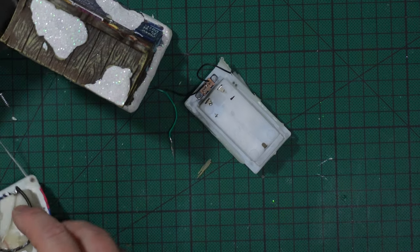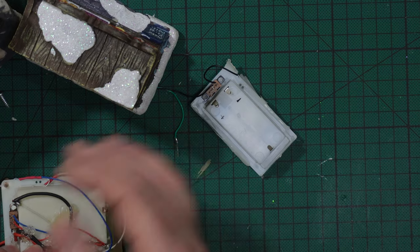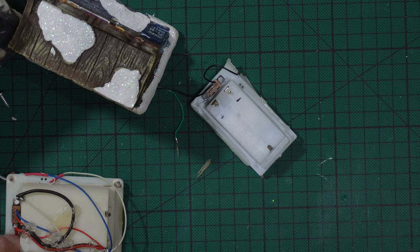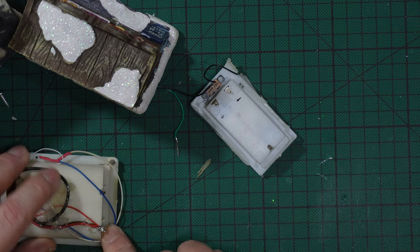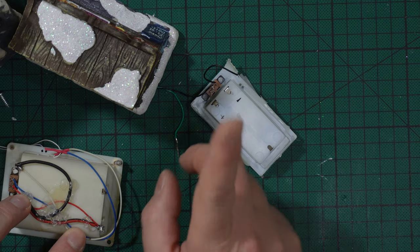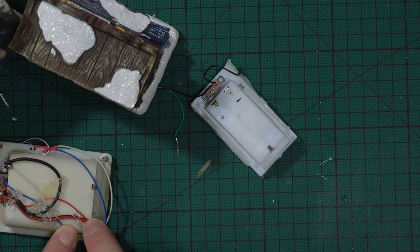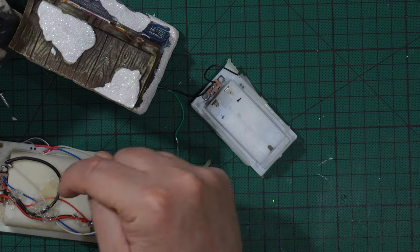And here, what I did is exactly what I just told you. Because even at the time, I knew how to solder, so the wires here are bigger. So I took the positive wire and I soldered it where the other positive was, singular or plural, it's not important. Soldered them together here, also the negative, where the negative was, and soldered there.